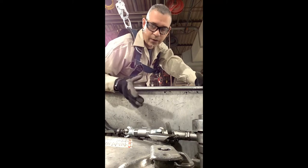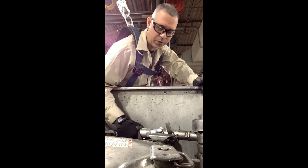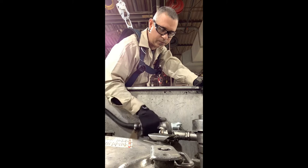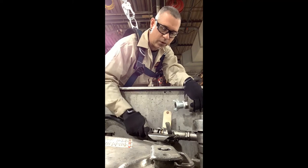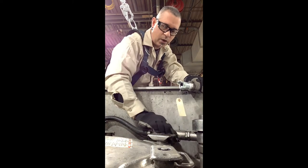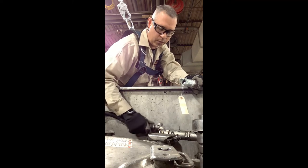So in this scenario, we're going to have to remove the one-way check valve by pushing and twisting. Remove it from the unload hose, reattach the unload hose, open the ball valve and uncouple.